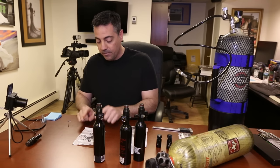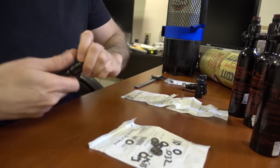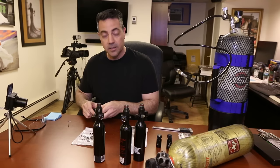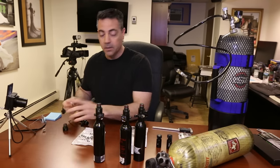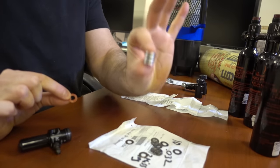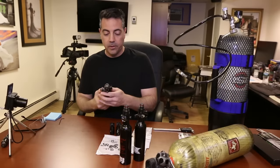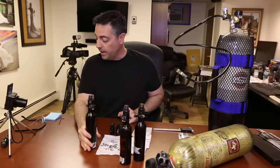Just to recap: Belleville washers replace the silver spring on the inside, and the shims go on the bottom. That's how we're going to adjust the 800 PSI output to something more — 11, 12, 13, 14 hundred PSI, whatever you're looking for. Belleville washers replace the spring and shims provide additional output increase if needed. Now we're going to remove the air from the bottles.